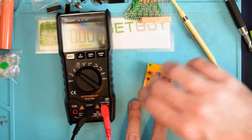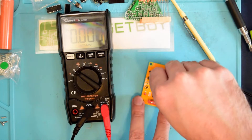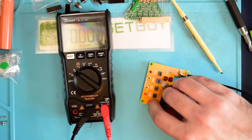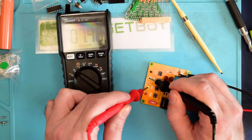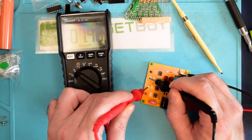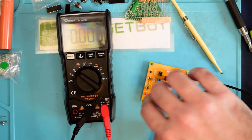Let's turn it off and switch over to 7.5 volts. Alright, let's see what the 7.5-volt range says. Minus 7.48. So this multimeter is seeming to still be fairly accurate.